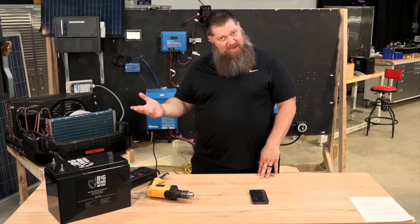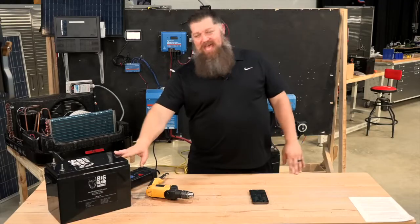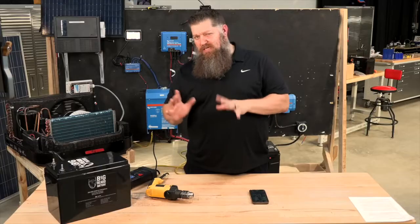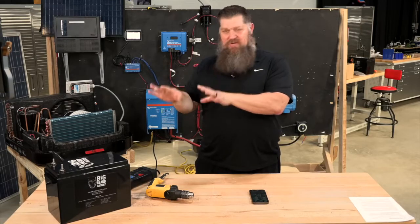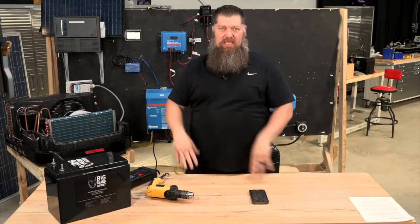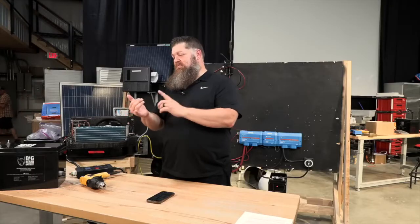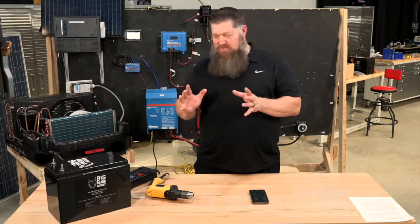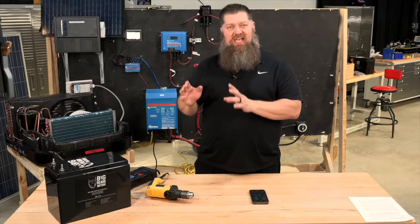So when you're looking at upgrading, you say: I know the air conditioner can pull upwards of this, and in an RV there are going to be other loads — you can't isolate it down to just the air conditioner. I added a couple other things, got it up to about 200 amps — one battery gets me an hour and a half. Two batteries: three hours. Four batteries: six hours. Batteries are there for the nighttime when you have no sun and can't run your generator, so if you're going fully off-grid, you need enough batteries to get you through the night since most places have quiet hours and we don't have lunar panels. We put it to the test and I'm quite pleased — we got over 200 amps and ran this for about four or five minutes, totally fine. Voltage drop between the battery and the inverter was less than half a volt, so good connections and the battery is not dying.